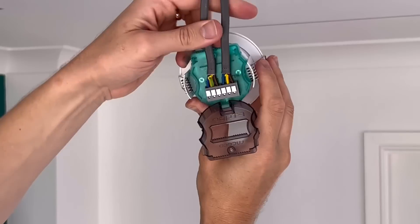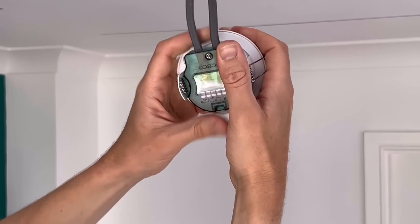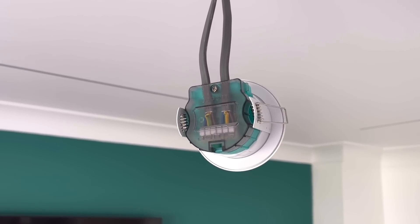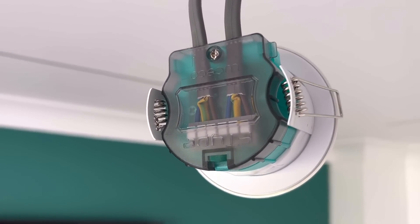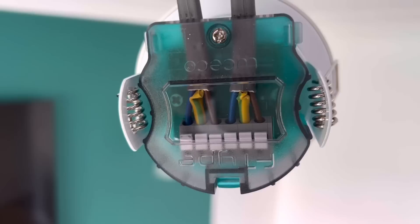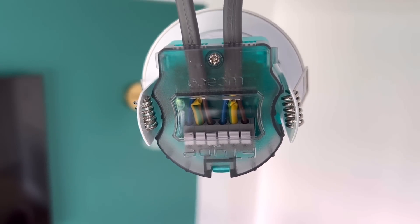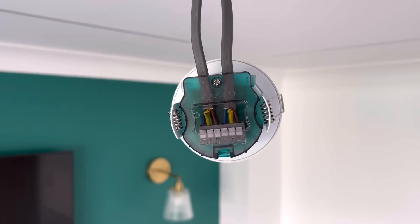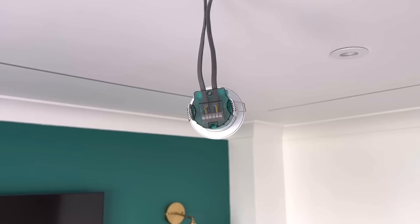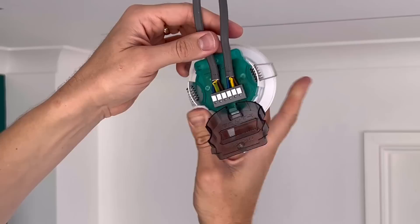The terminals are push-fit, meaning you don't have fiddly little screws to do up and double, triple or even quadruple check. They follow the line-in, line-out pattern, and once the cables have been quickly and neatly installed the lid closes down and clamps the cables in position to prevent strain on the terminals. Rather than hiding the terminals behind a blank piece of plastic, the lid has a little window built in, meaning that after you've finished terminating the conductors and just before you push it up into the ceiling you can peer in and make sure the conductors are firmly in place, haven't moved around and are in the right connections. This increases the safety of the installation as you can literally see that the cables haven't popped out and aren't going to cause arcing. I think that is innovation at its best — simple, functional and transferable.